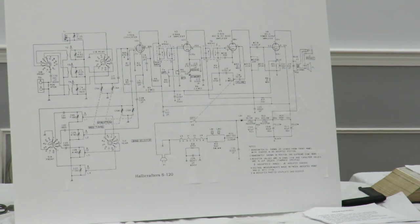Right. So this is all theoretical, because we're talking about what could be rather than what is. But if you want to be totally safe and you don't know what's in your test equipment, run it through the isolation transformer as well.